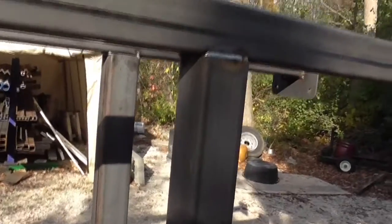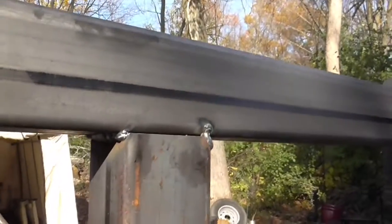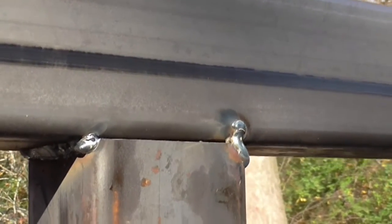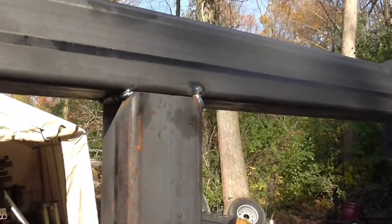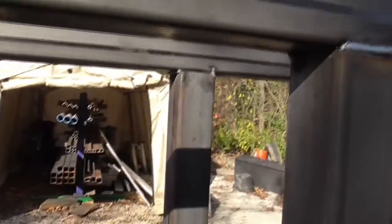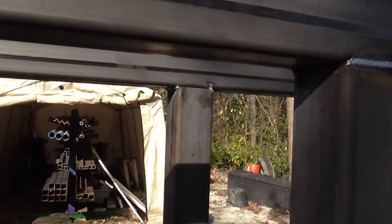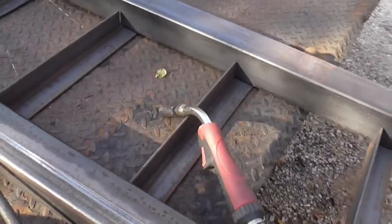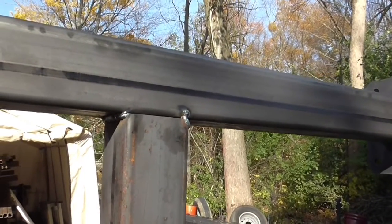To give you a quick demonstration of what it looks like, I'm going to weld. The material is fresh — not ground super clean, but that's fine for MIG. There's no rust and no heavy oil coating, just smooth steel. Every time you hear the arc sputtering and stuttering, and the tip is brand new in the correct size — I'm running 030 wire with a 30 tip — that sputter is because of the liner.